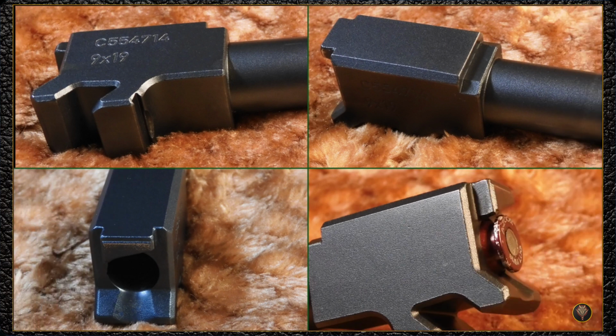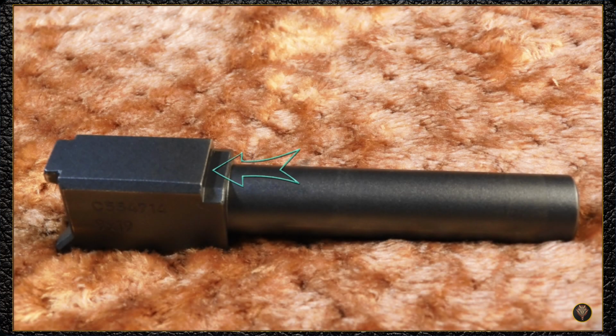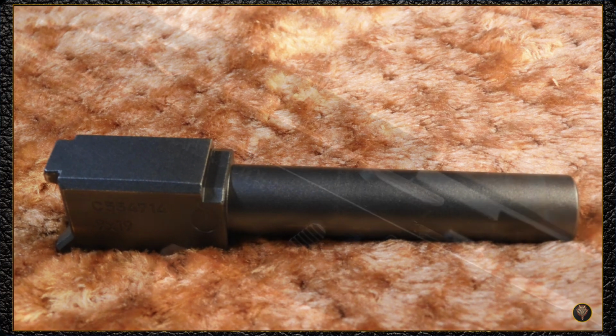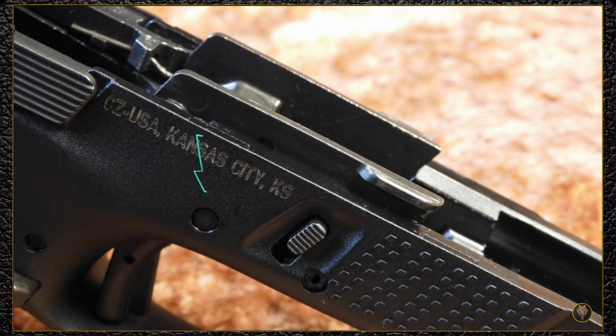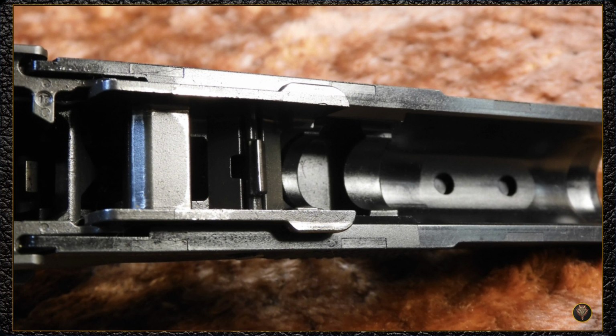The 4-inch barrel is of the John Moses Browning tilting barrel locking design and exhibits excellent cartridge case base support. You won't experience any case bulging with this barrel, as can be witnessed with Glock barrels and some others. The barrel locks up forward of the chamber, and it does lock up very well. The front insert or locking block assembly is held into place with one pin, the front insert pin that also serves as the trigger pivot point. The locking block assembly is well embedded in the frame for maximum strength.